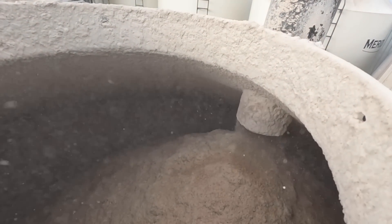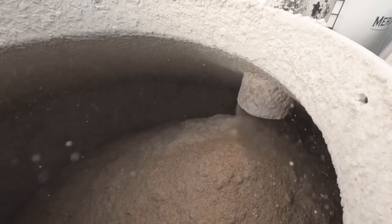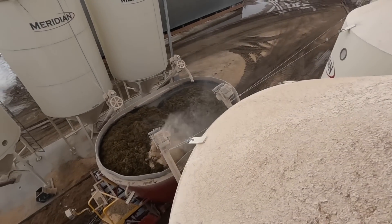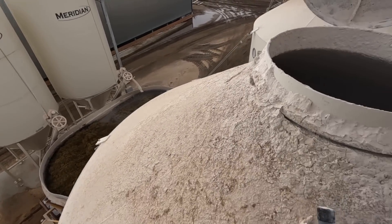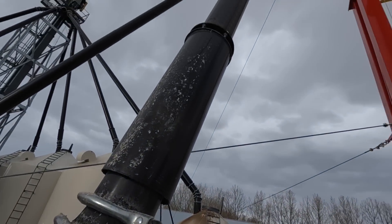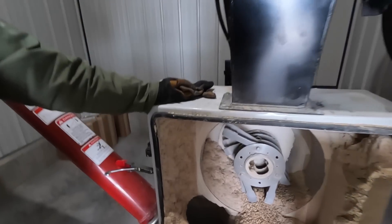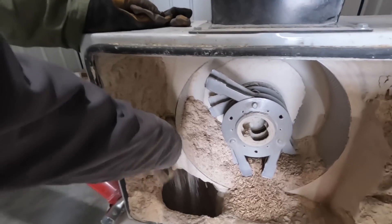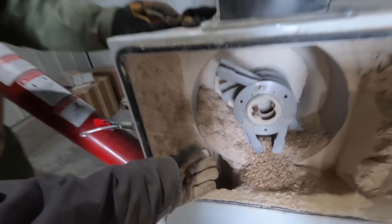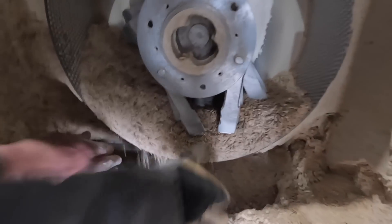She's right full too — it'll take some time for that to flow out. Firing up the feed wagon now so this bin should slowly go down and then that pipe will empty out. Just opened up the hammer mill — it was all packed in there. The full bin switch didn't turn off the system. Yeah it's packed in there heavy. You can see a little bit of oats that haven't been mushed through yet.